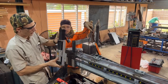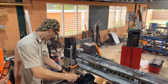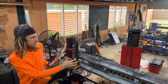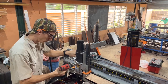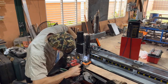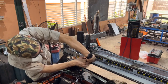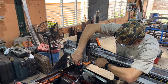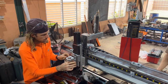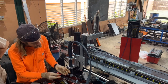Now working on the z-axis — drilling holes in the different plates. We have spacers between it and the y-axis because of the screw heads that stick out from the y-axis plate. Getting everything adjusted to ensure it's perfectly plumb in all directions, square and parallel to the table, so that as it cuts material it will make very clean, straight 90-degree cuts. Drilling the holes, filing the back side, putting nuts on and tightening them. You can see I just installed the magnetic breakaway and the 100-amp plasma torch.